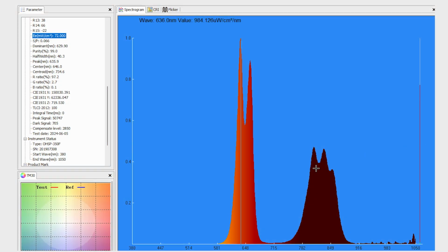Okay, so I did one quick snapshot. You can see 5 different peaks here. So there are 5 wavelengths, so that's good. Let's see if they line up. The first one is about 635, so not too far off the 630. The second one is 659, so yeah, we're bang on the 660. So remember, you're getting quite a lot of light right through from 630 through to 665 perhaps. In the near infrared, we have 3 peaks, 810, it's bang on, which is awesome. 832, so yeah, pretty much bang on. And then finally the 850. So everything matches up there, no issues.